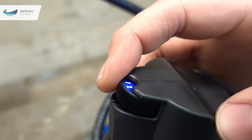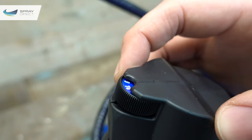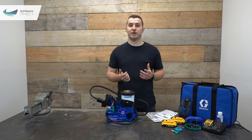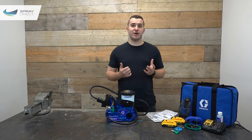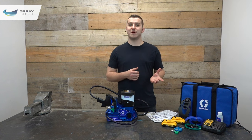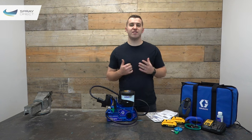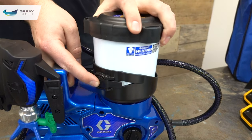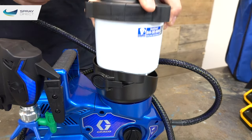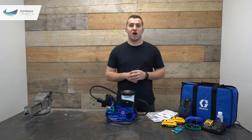We also have the pressure or flow control on the back of the gun, making it easy to adjust on the go depending on the job, rather than going back to the pump as with conventional units. At the lowest setting we're at around 100 PSI, increasing up to a maximum of 2,000 PSI for thicker materials. Another feature I'm a big fan of is the 900ml cup system — it's completely removable with a simple clip on the side, giving easy access to cleaning both the cup and the filter.